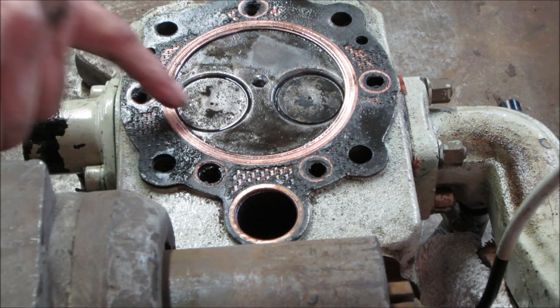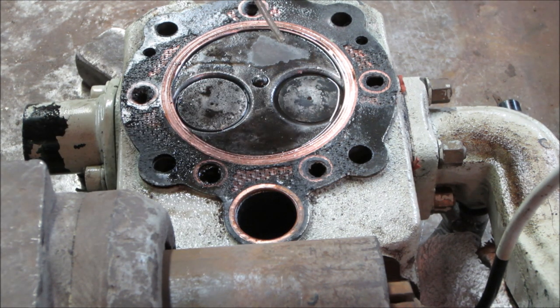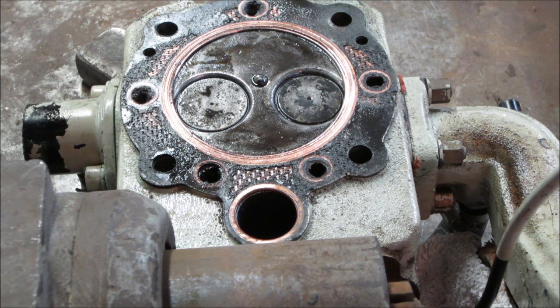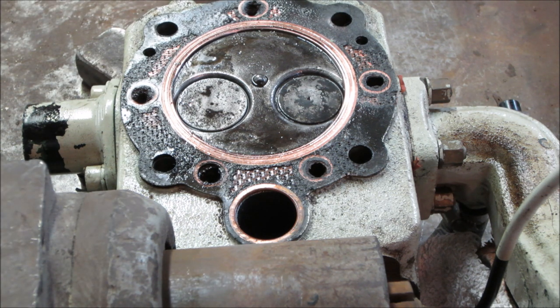It's slowly going down around it. You can see it. Actually, it's not terrible. I expected it to really be worse than that. Again, that's with no spring holding it down either. You got to think of how fast that piston's moving, squeezing that compression up, squeezing it together real fast and back. How much time it has to go leak around it. So, we'll see. Go get that piston and see if we can get those rings free. That's the next obstacle you need to get over.